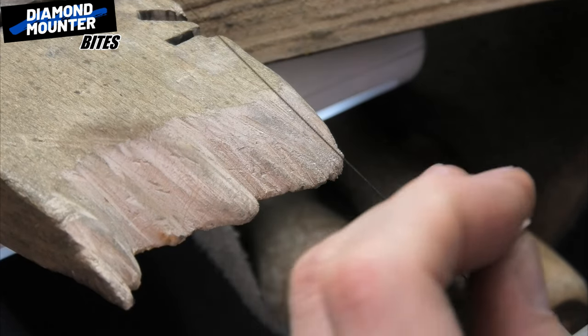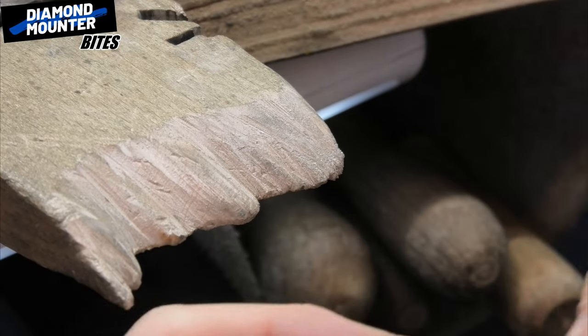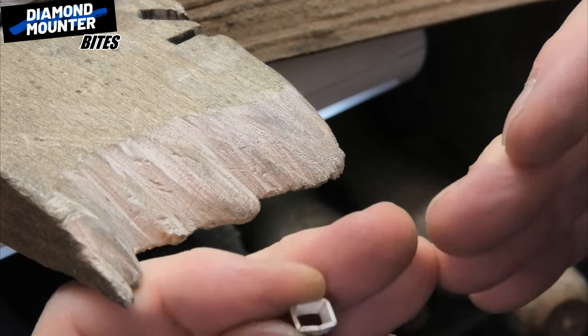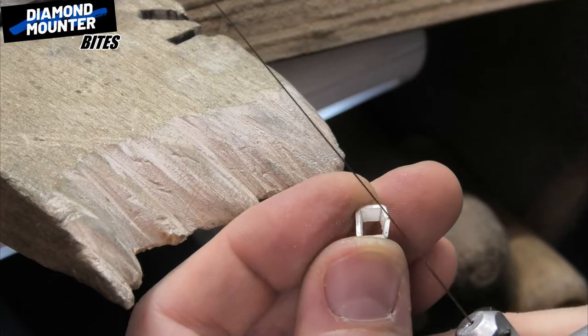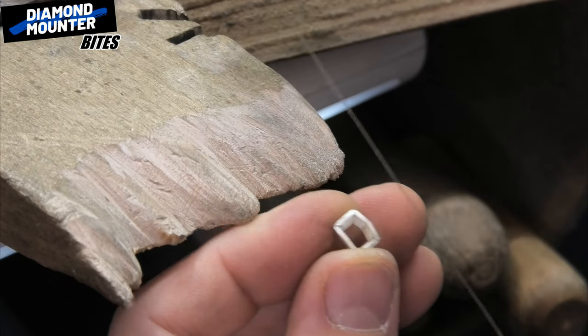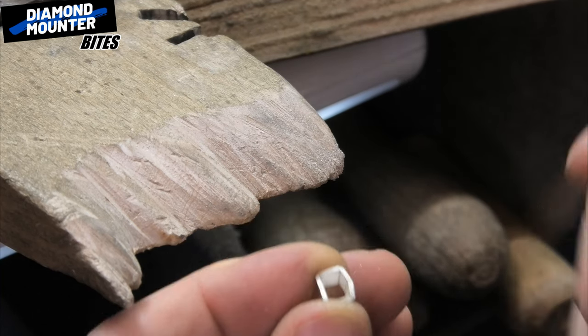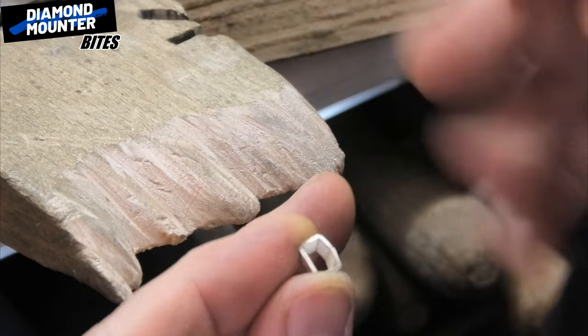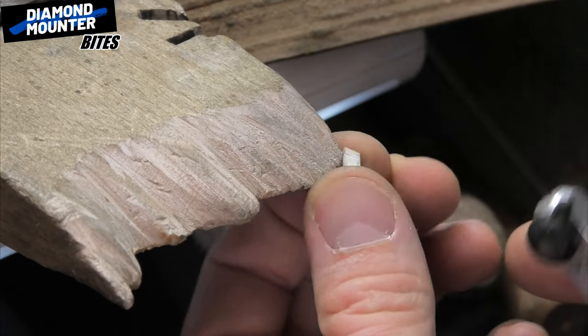What I'm going to do is put a thicker saw blade in. I'll cut through it, cut through the join, and it will fold up — it'll be a nice tight join and a little bit closer to being straight. I'll probably have to cut through it two times and then it should sit nice and straight at the correct length. Obviously you don't want to go too short because then it'll close up too much and it's not a nice straight right-angled piece anymore.